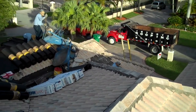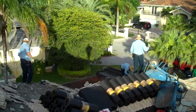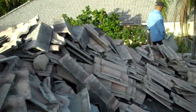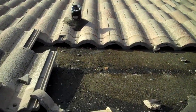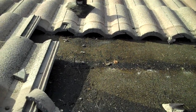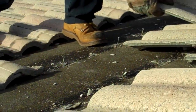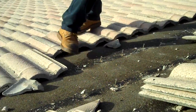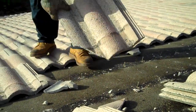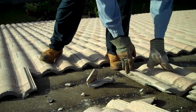This is a beautiful house. They have a concrete tile roof and due to leaks we are replacing the roof. One of the reasons it's leaking is that the tile is only nailing — there is no foam or mortar on this tile, it just nails down to the deck. And you can see how easy this tile comes out. In the event of high winds, this tile will be flying.